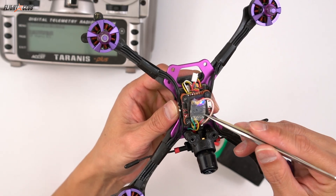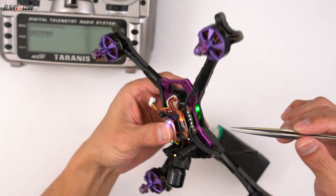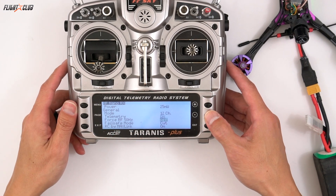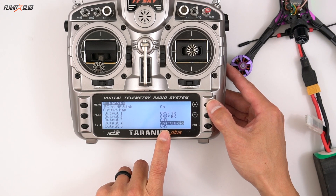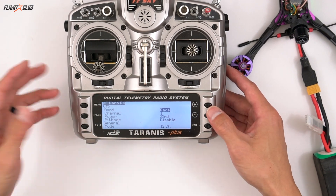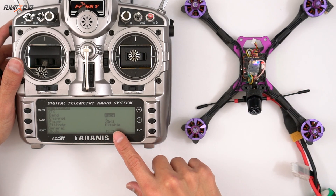To use Smart Audio on your Crossfire, connect the smart audio wire from your Unified VTX — it could be the Pro 32 or any other Unified — to channel 4 on your Nano RX. Once you have it connected on your quad, go into the Nano RX settings. Right now the VTX settings aren't showing up, but once you change the output on channel 4 to Smart Audio and hit enter, back out and go back into the Nano RX. Now your VTX channels are showing and you can just change it to whatever you want. Note that on the Unified series VTX, some channels like Raceband 1, 2, and 3 are locked.